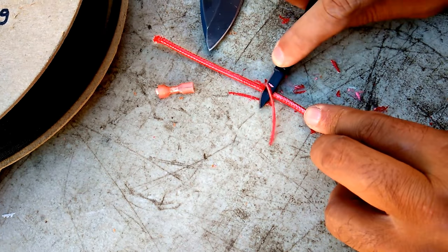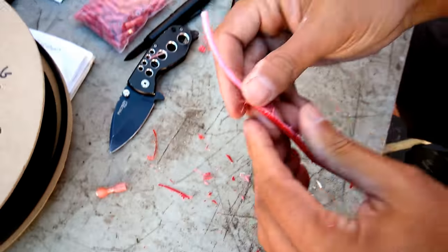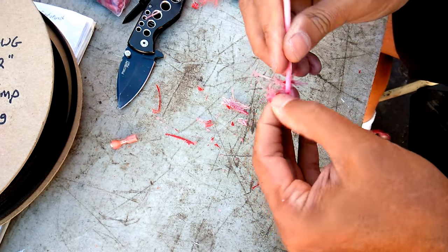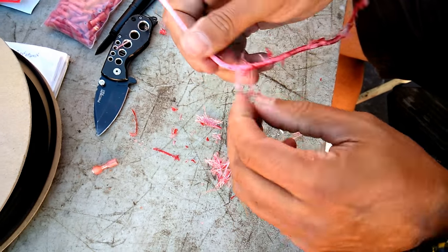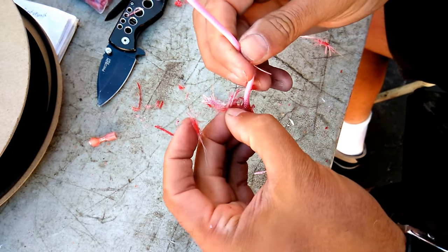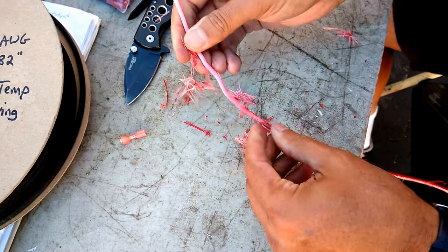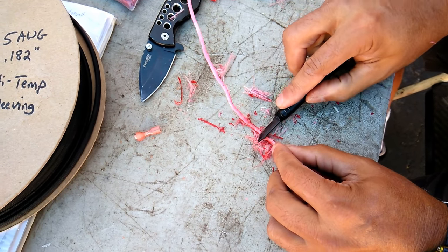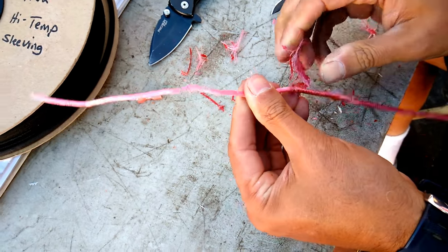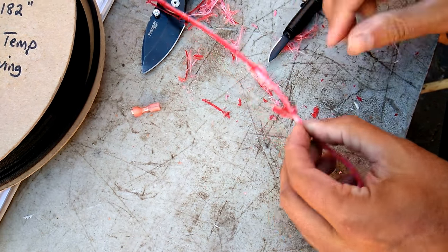Naturally, the longer the wire, the more patience you're going to have to have to do this. The covering is cloth, so it's kind of messy — kind of like fiberglass almost, but it's not fiberglass because it's high temperature. The insulation I'm replacing it with is Insultherm. It only comes in one color, so I'm not going to do a full color-coded replacement. For me to get different colored insulation for every wire would be absolutely ridiculous, so I just get a nice long roll of the insulator.